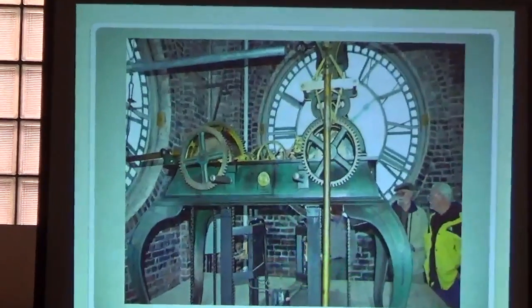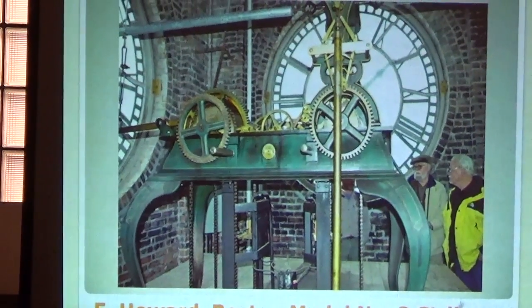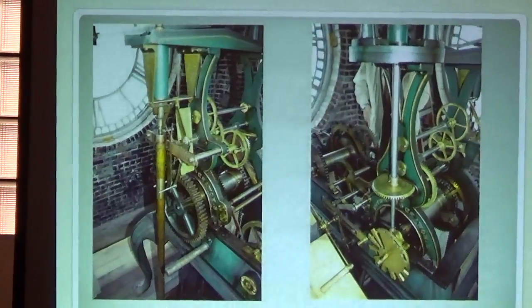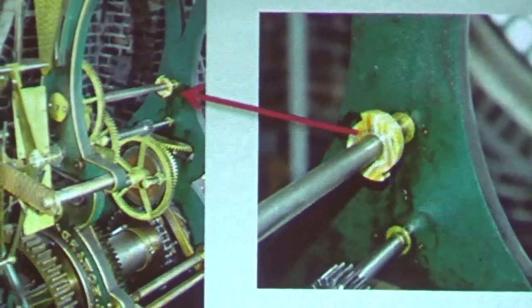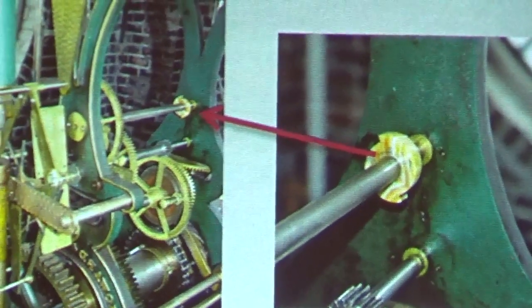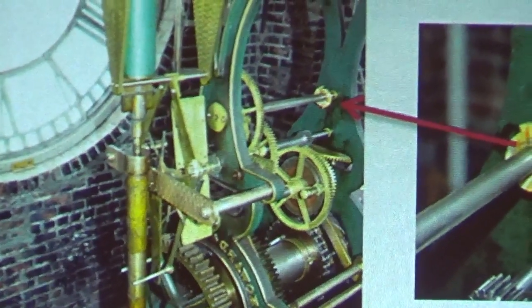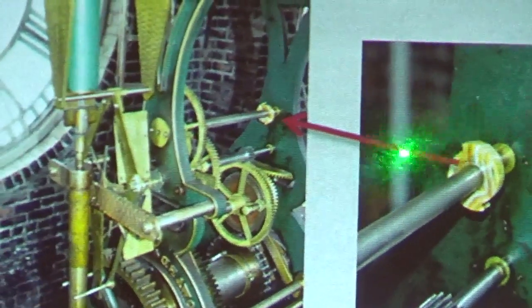Next. And you can see part of the winding system. A couple of tower clock nuts over there. Yeah, they had to fall. Next. Family. Next. This just shows some of the details. Just scroll through these. Go ahead. Now this is the only thing left of the time system. A 2-lobed, and I believe it's probably agate cam. This made a contact, 2 contacts every rotation. In this kind of train, the so-called minute arbor goes around once every 2 minutes, so you needed that. But that was how the time signals got off. There were some contacts here that operated on.